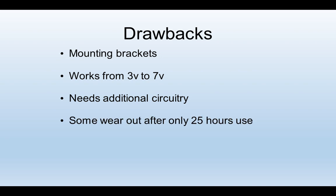If you buy clones, they can wear out in as little as 25 hours of continual use. But don't panic — if a point takes three seconds to slowly move from one end to the other, that would still mean 30,000 point operations before it got beyond the guaranteed wear. So even cheap servos can be very long lasting.